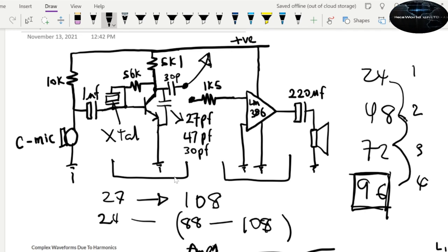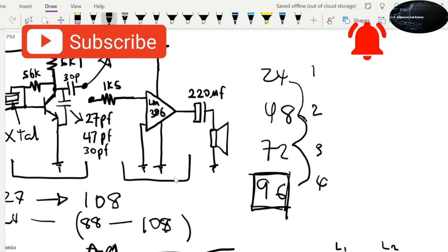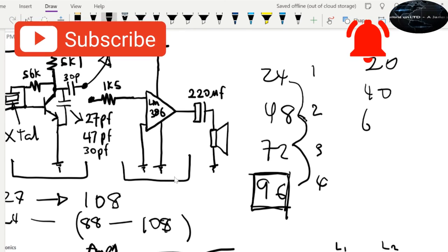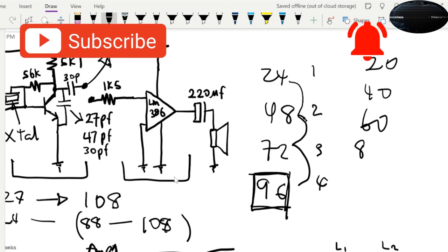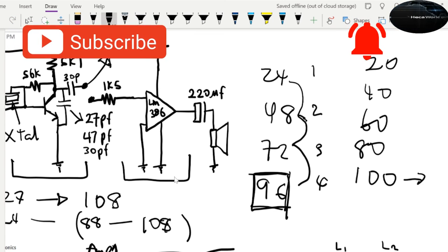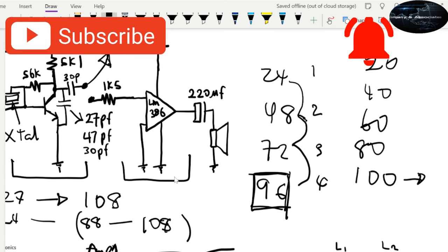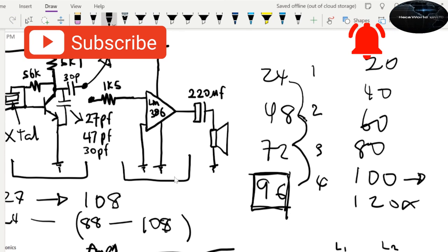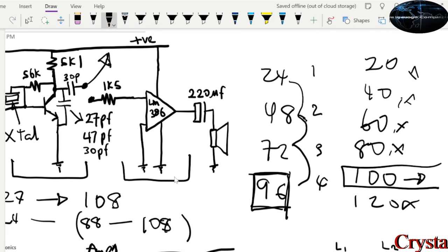If you're using a 20 megahertz crystal, your first harmonic will be 20, second harmonic 40, third 60, fourth 80, still below FM range. So fifth is 100, so you can expect to receive something around 100. The sixth will be 120, which is beyond FM range. So really, you can expect it to work around here.